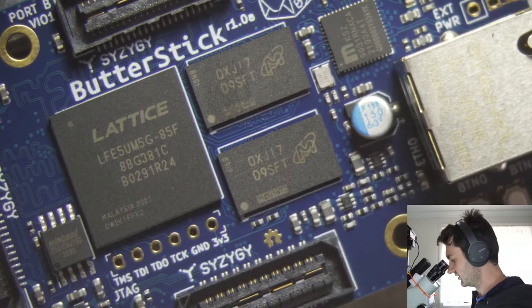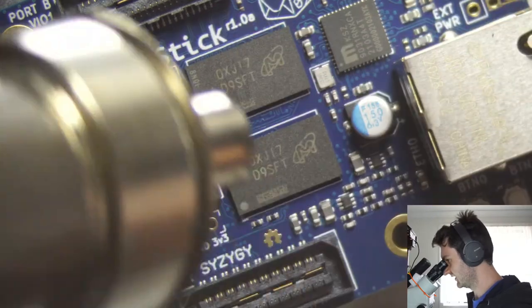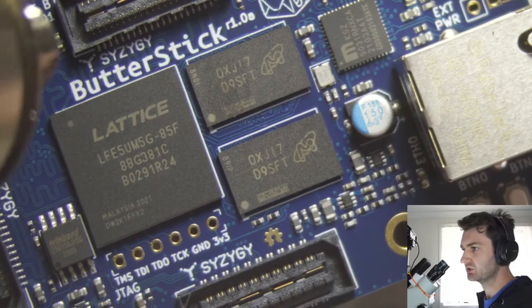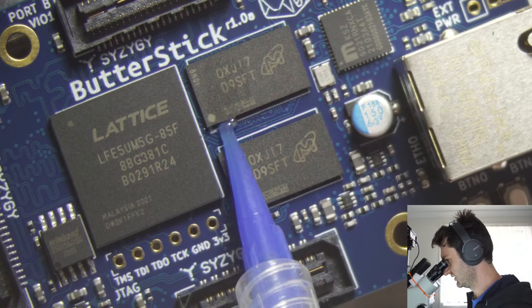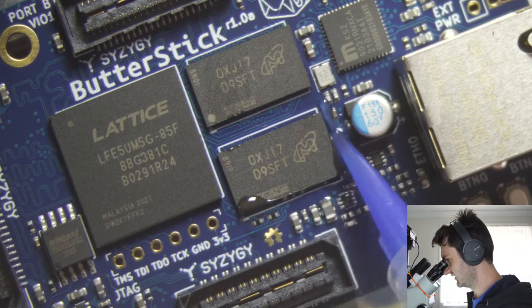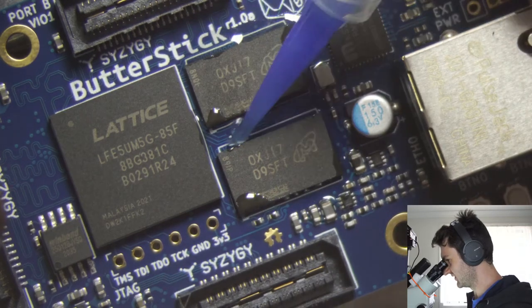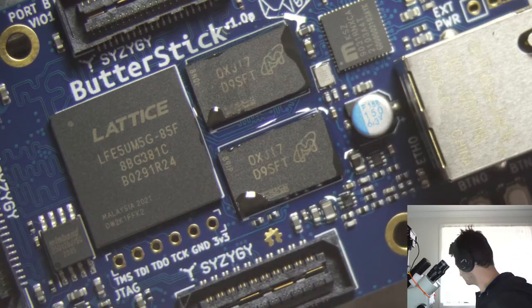And then the temperature on the board is really controlled by the distance that you're holding the hot air gun away, rather than the temperature you actually set, because the temperature you set is really inside the nozzle versus what's actually on the circuit board. That's one thing with hot air rework: you might think you'd never want to heat a board up to 380 degrees, but the circuit board doesn't actually get that hot. It's just the temperature in the hot air gun.